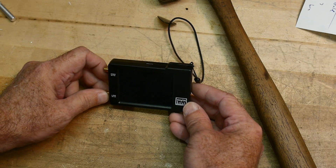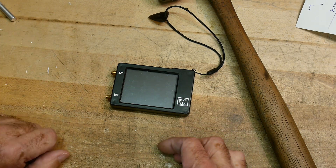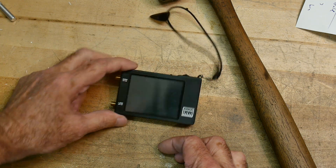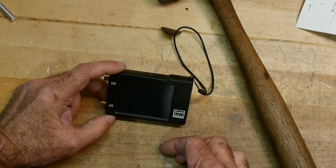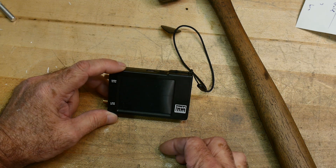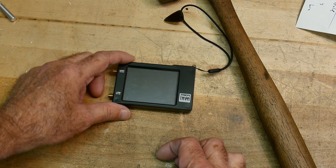There is a very, very simple test to step through the attenuator and make sure it's working. Most instruments step their attenuators and measure them and cal them out, because you can't just trust attenuators at face value — you need to actually measure them and have cal data for them.